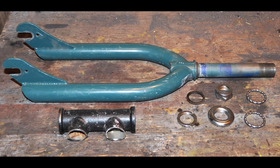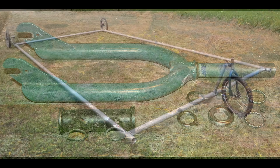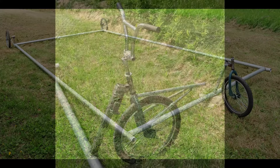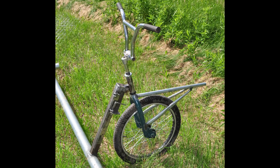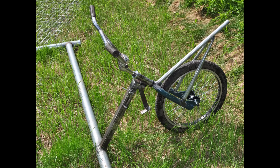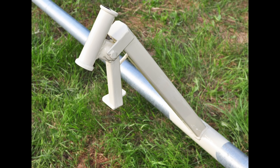Just about everything I make is built using recycled parts, so I never throw any metal parts away. It only took a few hours to get the basic frame set up — here it is sitting on blocks, ready for the landing gear to be welded to the main frame. I keep my welder on a cart so I can bring it over to where I need to work. The front landing gear is the most complicated part of the entire project, but it's just made from parts I had laying around: some bolts, extra tubing, and more bicycle parts. This photo shows how the front end pivots, allowing the frame to drop right to the ground. The lever out front gives you mechanical advantage so it's easy to lift the heavy frame. Since I'm working outside, I usually paint as I go so the parts don't end up rusty.